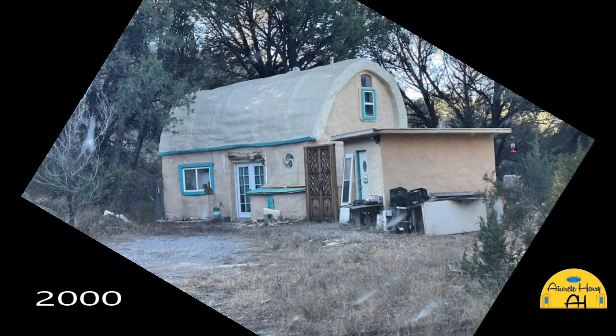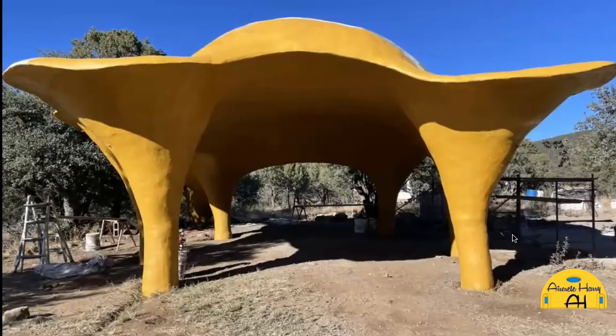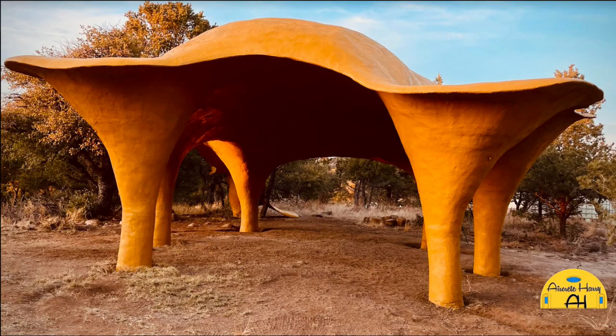But that's not the system I use anymore. That was the old parabolic stress skin system, because I found that building with grade beam foundations was not as strong as building with these columns. This is the better approach, I've learned. It gives you a lot more flexibility, and it's much stronger, and you're reducing the amount of cement by 90% for your foundations. We had a foundation man come out and cast regular concrete for that home, and it took more cement than the entire building did.